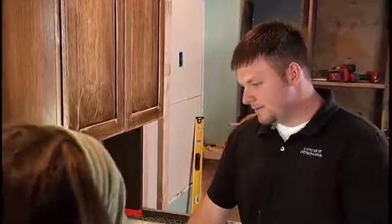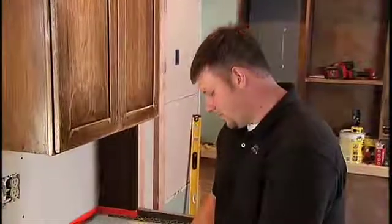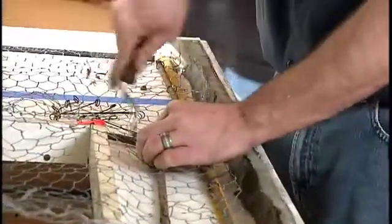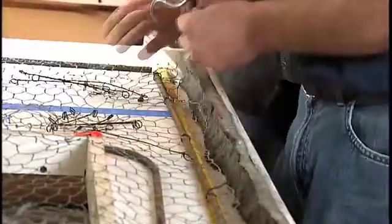And then what about the edge? I always think, well, could it break, with leaning on the edges and so forth? Do we bring it all the way out? Yeah, we brought it out within an inch of the actual edge. If you go too far, you take the risk of exposing your reinforcement through the concrete.